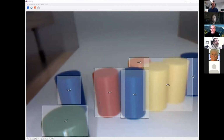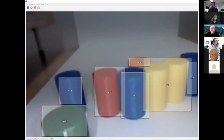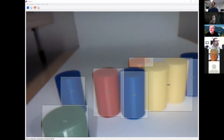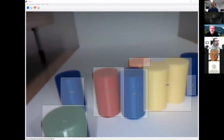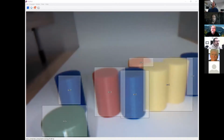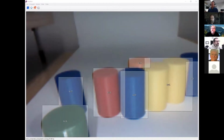One last thing too, and on that, Chip, remember what I said, you don't have to use 19.2 kbaud because on the P2, we can go as fast as the PixyCam, which I think is 230 kbaud at its fastest bit rate, which we obviously can support in a P2. Oh yeah, I was thinking of just the fact that these little cameras exist that have these resolutions that you could read them straight into memory and process the data directly.